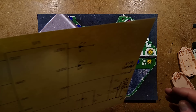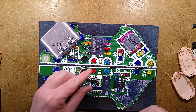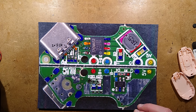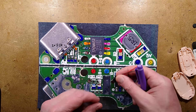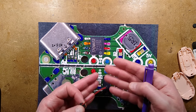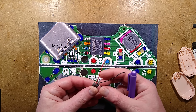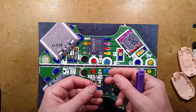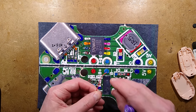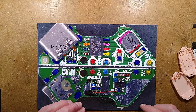What a shame it's just lack of quality control — someone just soldered those connections on back to front. It makes me wonder how many are similar. One advantage of having the connector fixed and mounted on the circuit board is that you can't really make mistakes like that — it gets soldered onto standard pads and you can't mix them up. In this case, because they've got red and black wires coming out, a tired factory worker, or one who's not been shown how to do things correctly, can just tack these on back to front.